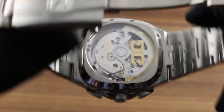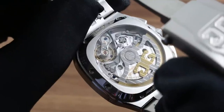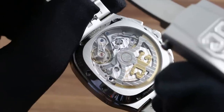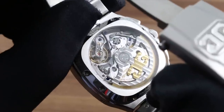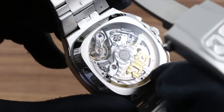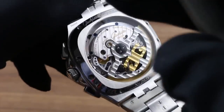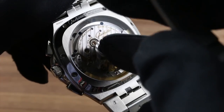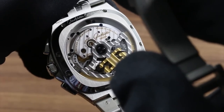Transferring to the display caseback of this 100 meters water-resistant timepiece, you see the manufacturer's chronograph caliber 3702. Designed, assembled, finished, and regulated entirely in-house by Glashütte Original, the movement features a superb 70-hour power reserve, plus or minus 5%, energized by automatic winding. It also features traditional finish in the form of Glashütte stripes across the winding mass and the primary bridge, as well as the unique double-spiraled finish of the winding transfer wheel, and the beautiful kiln-fired cobalt blue of the assembly screws.